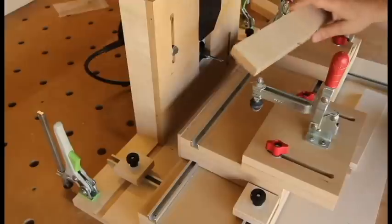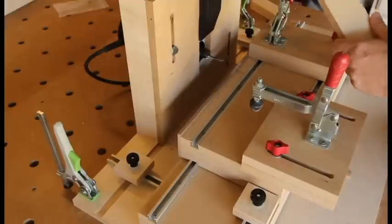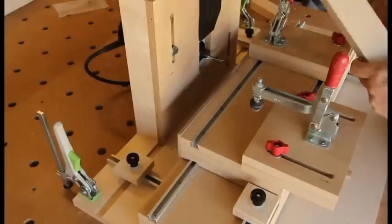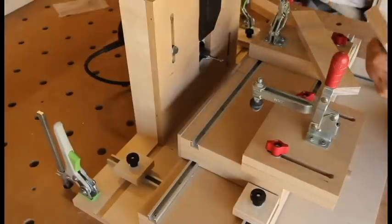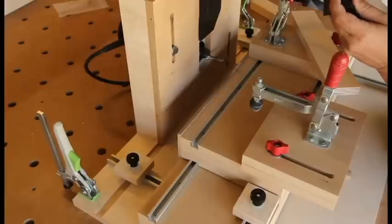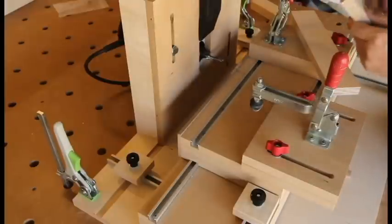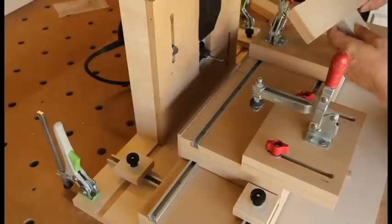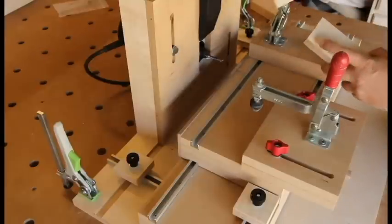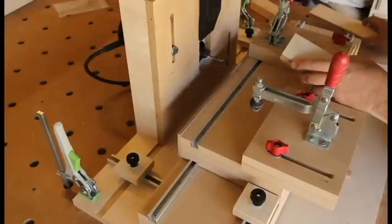Now, you want to make sure that wherever you're doing your mortise, that whatever side is matching up. Oh, there's my mark there. I want to make sure that the top is to top, bottom is to bottom, so that way everything lines up the way you want it to, because you might not get the height exactly in the center. So that ensures that everything becomes completely flush. So these are my tops basically. If this is the good side, you might put it down. It depends on if you're going to have an offset, that kind of stuff.